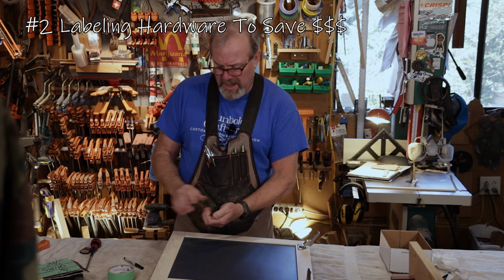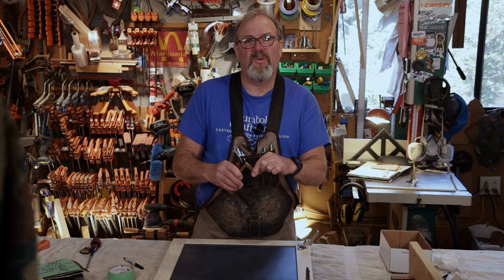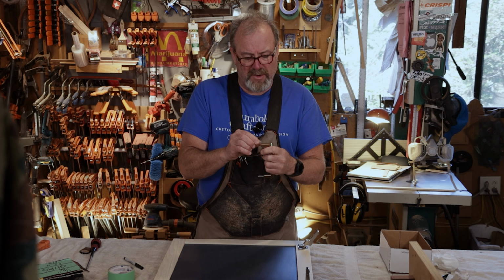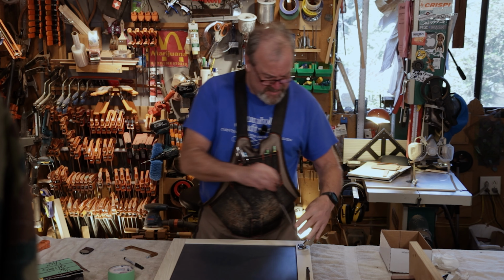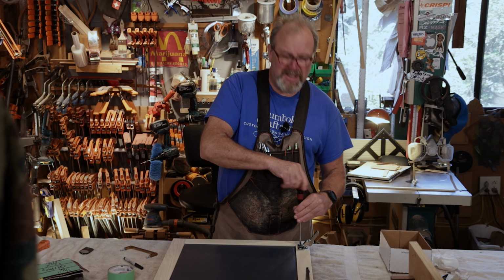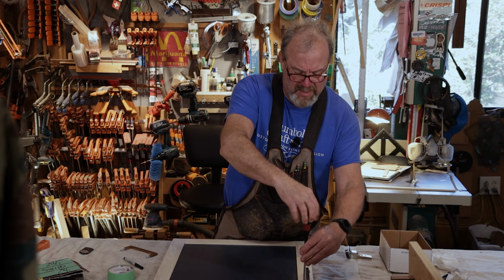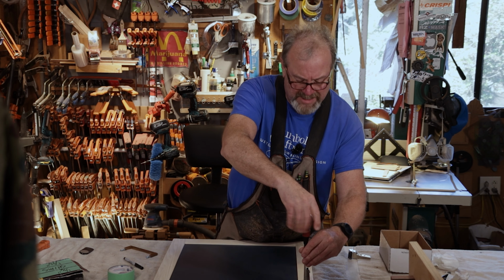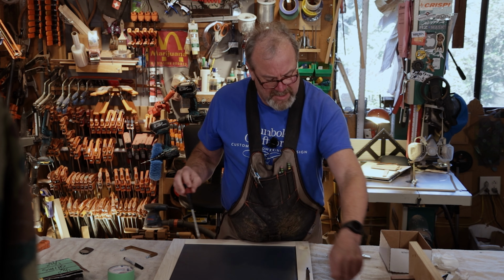So if I had one thing to tell myself when I was younger, when I first started out in this business, it's to make sure that when you take the hardware off all of your doors and drawer fronts, before you put them away, label what door they came from, top, bottom, and middle. I didn't do that when I was younger, and it took so long to get this stuff back together, because I've adjusted these hinges for the opening for whatever door this is. But if you put this on another door or another cabinet, it probably won't be the same, and you'll spend hours trying to get all your doors set after you've already done it once in the shop.